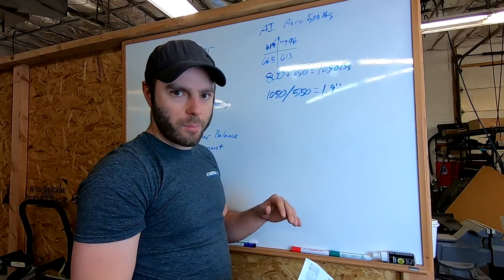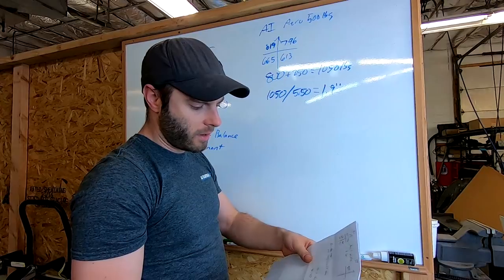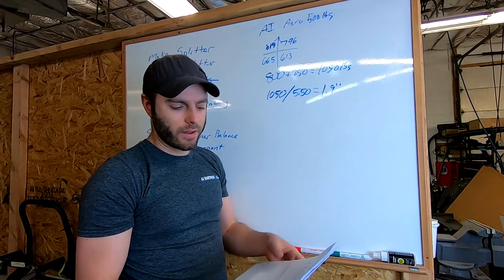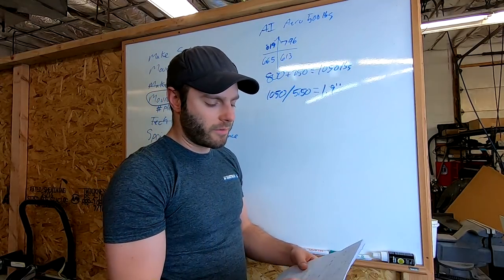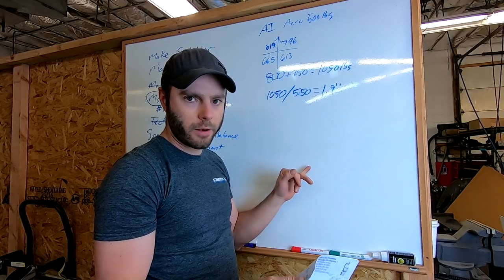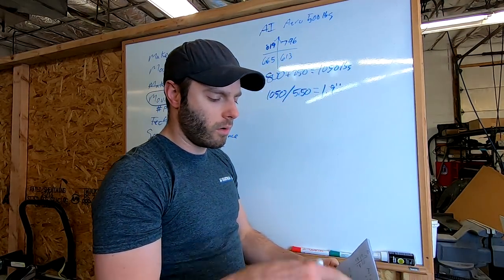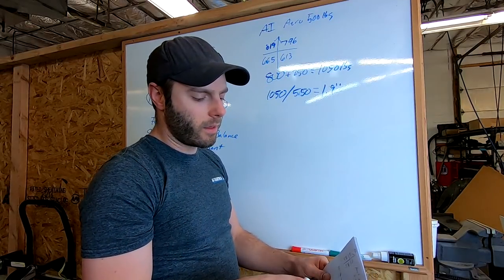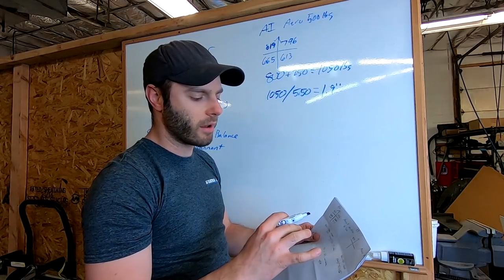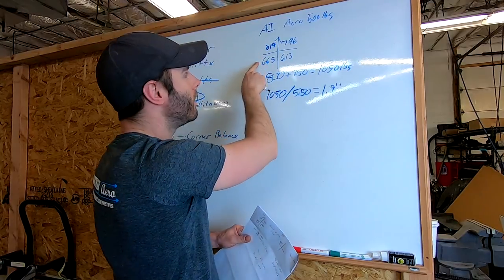We just so happen to have 750 pound springs sitting in the corner from an old job. So we know we want stiffer springs, that's obvious. Again, from the CFD that we did, we know that the new wing and the new splitter are going to put more aero loading on the car. So we're going to assume that the splitter will put about 800 pounds across the front axle, so about 400 a corner. So we're using the same corner weights.